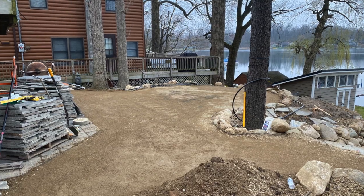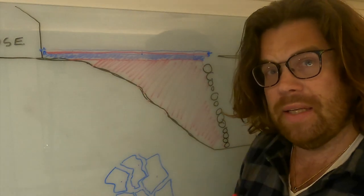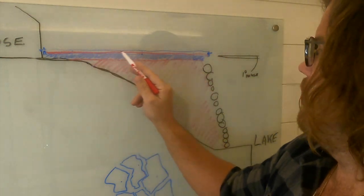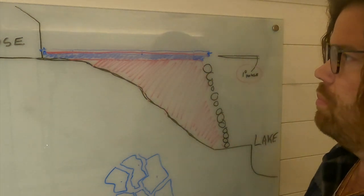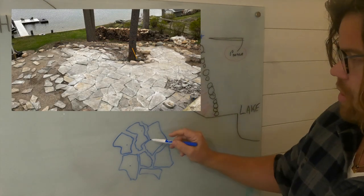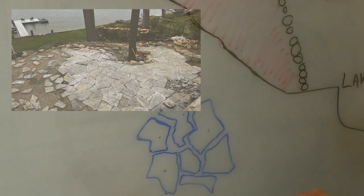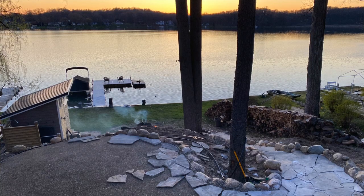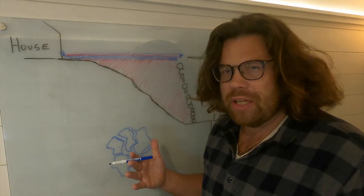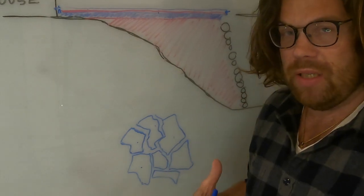This step takes a lot of work — a lot of material, a lot of compaction. Take your time. If it's not level and not completely compacted, your patio is going to settle in uneven ways and not look good. Once everything is compacted and angling roughly one degree, the next step is to start laying the stones. You start puzzling the pieces together — a fairly complicated and hugely time-consuming part. I was shooting for as small gaps as possible, half inch to one inch. Some people do two or three inch gaps. In between the gaps you use polymeric sand — I used the Gator Dust brand, which I highly recommend.